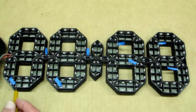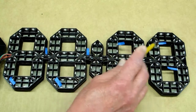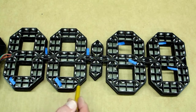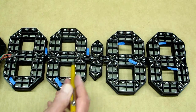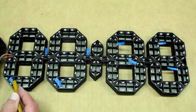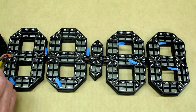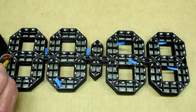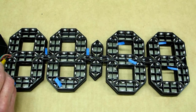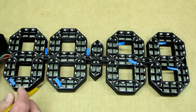The designer has very good instructions in his construction article, and you continue until you get back to the end point. I've marked each solder joint with a piece of blue tape so you can see where they're located. At those joints you don't have to bend the strip — it just clears. There are 8 solder joints to this point, which is 240 LEDs plus another 12, totaling 252. Power comes via the red and black wires putting DC voltage to the end of the string. It comes back to the beginning, the red and black go to the Arduino Nano, and the green wire is the signal from the Nano.